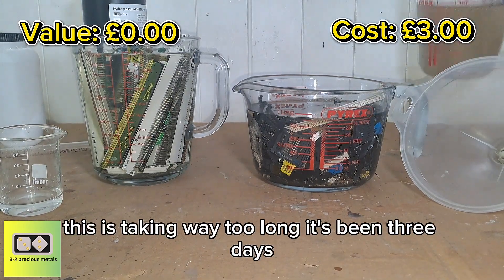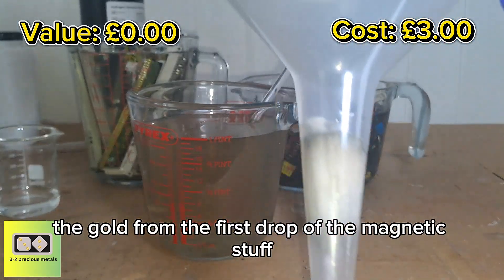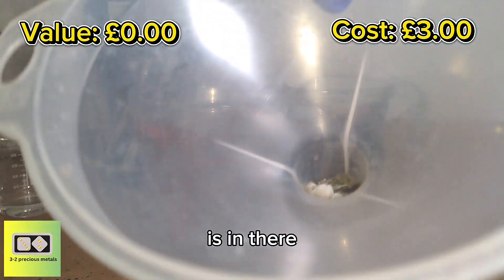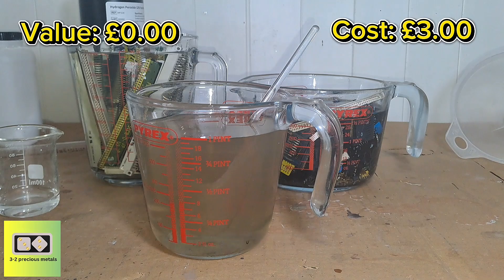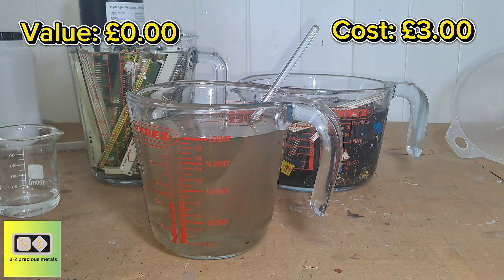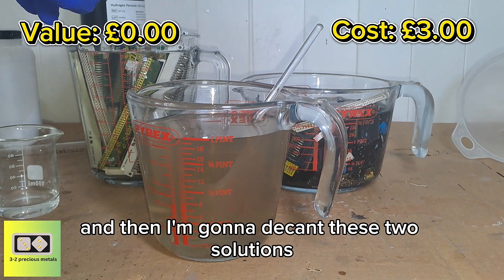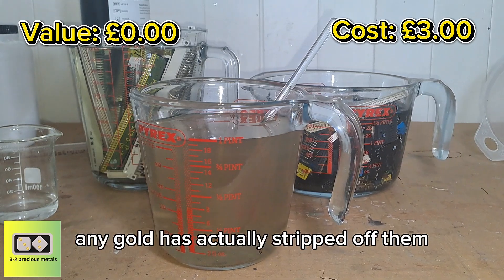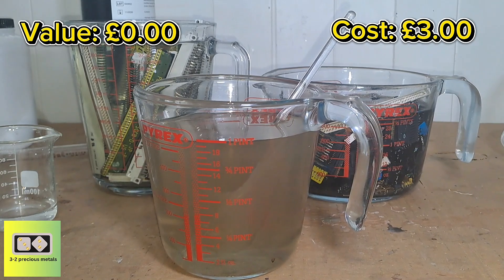So I think what I'm going to do with the non-magnetics is what I said I wasn't going to do — I'm just going to put them all in a bucket and throw some nitric acid in there and remove the gold that way. This is taking way too long, three days in and I'm not really getting anywhere. The gold from the first drop of the magnetic stuff is in there — it's not a great amount, but I wasn't expecting it to be anyway. They all add up. So I'm going to drop the gold out of this one, put it in with the foils from the fingers, then decant the two non-magnetic solutions and put some ascorbic acid in there just in case any gold actually stripped off. Then I'll get them in some nitric acid.